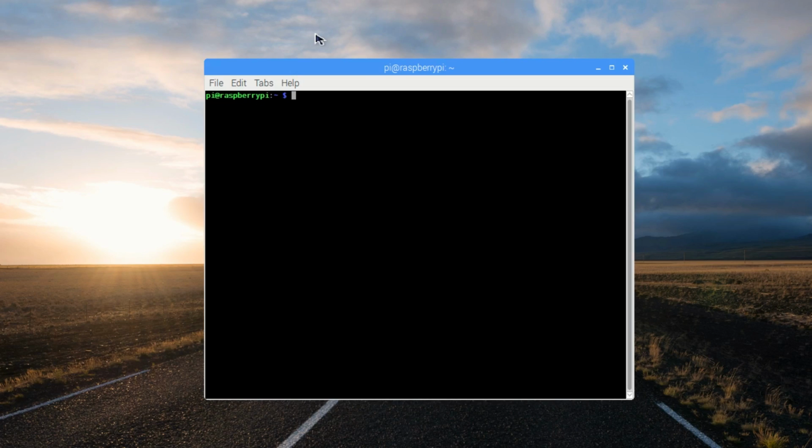Once you've wired up your circuit, apply power to the Raspberry Pi, boot it up, and open your command terminal. Before we get coding this time, we need to make a few tweaks to the Raspberry Pi. Our temperature sensor needs to communicate digitally with the Raspberry Pi's GPIO system using the I2C protocol. To turn it on, type sudo raspi-config.